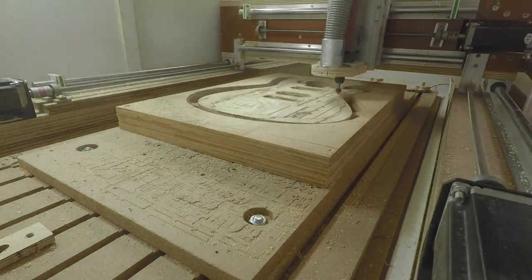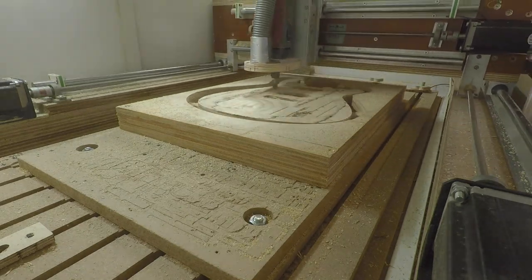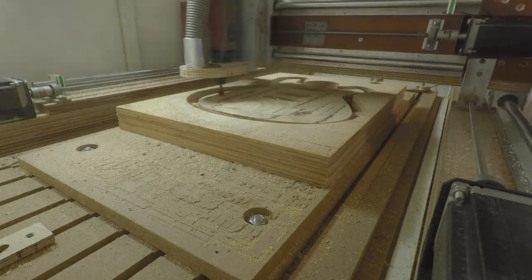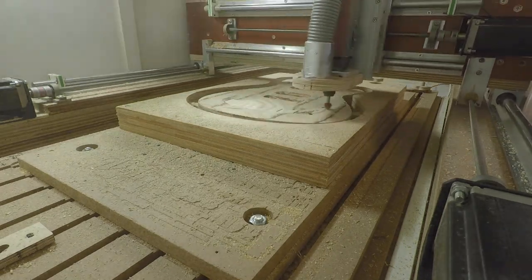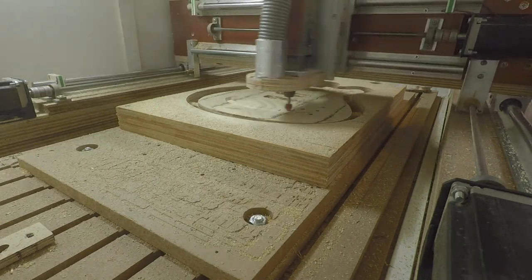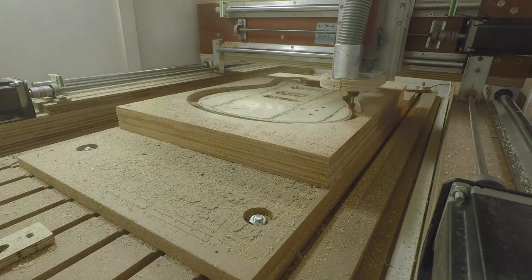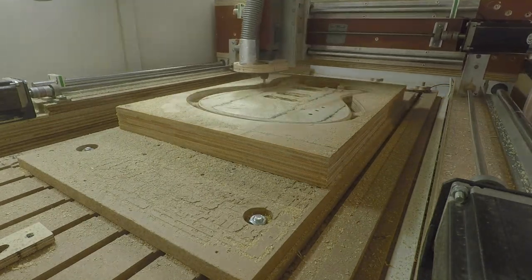There's not much material coming up — about half a millimeter per pass. The total machining time for the bottom process was 40 minutes and for the top process about 30 minutes, so I'd say I've reached my goal. If you don't need the scallop process it would gain you 15 minutes per side.